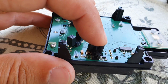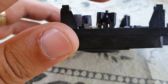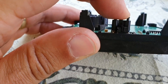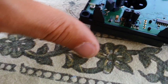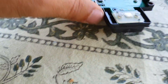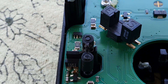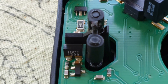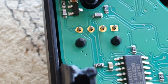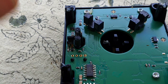We have this push button, and as you can see it has two transistors — or diodes — in there. Every time you push this, it measures the signal between the two contacts to know if something is pushed or not. So we have to check this first. I'm going to put the camera closer — check this out, I've already found our problem. See that? The solder from this diode is cracked — it's out.